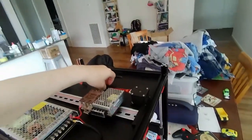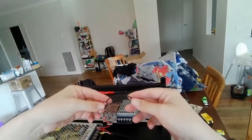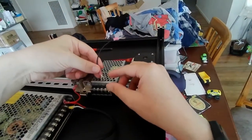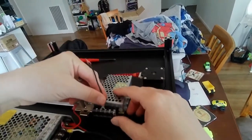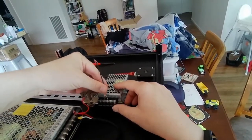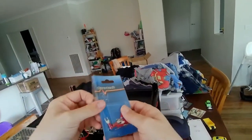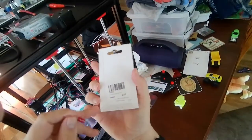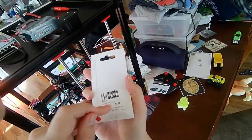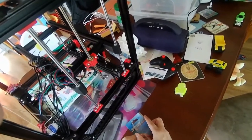Now the next bit I'm going to do is wire up this part. This bit's a little bit trickier if you don't have the right stuff. Look at these connectors - this is a 5mm spade connector. It doesn't fit at all. So what I've done is gone and grabbed a set of 3.7mm fork connectors. These are QC fork 3.7 red, from Jaycar - they cost $2. Let me get three of these out.